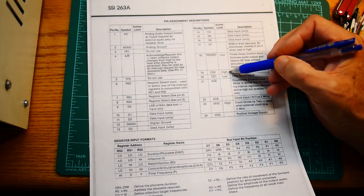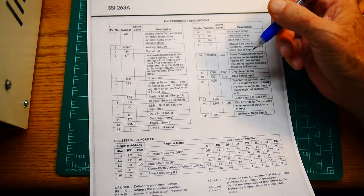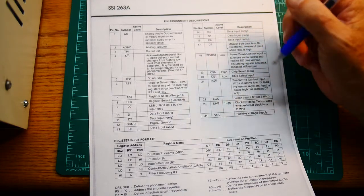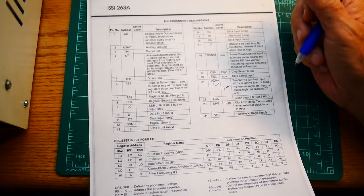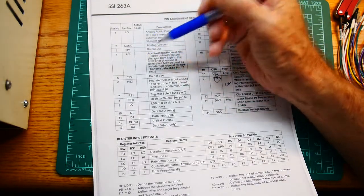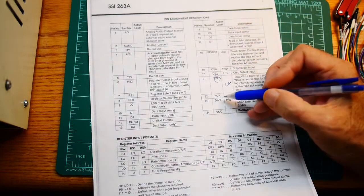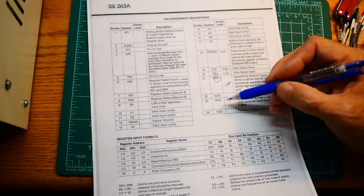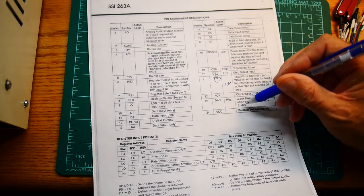We have a chip select input — we'll pull that high. Chip select output low — we'll pull that low. This says don't reset. And then we have a write or a read — I believe we'll just be able to tie that to write only, so we'll just tie this low, just enable the write part of it. You don't need to tell the direction of this pin — it's always an output. These data lines D0 through D7 can either be input or output, but we're only going to use this as input, we're only going to write to this device. Then clock — we'll have to find clock on the S100 bus. It says here 1 MHz or 2 MHz. There's a divider internal to the chip — you can divide by 2 if the clock is 2 MHz, so I guess it's looking for a 1 MHz clock.